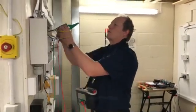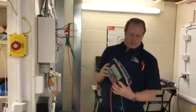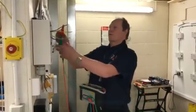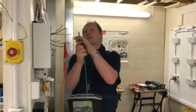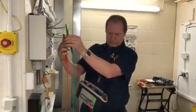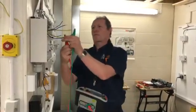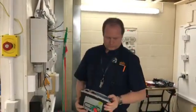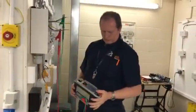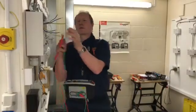For step one, we're going to go end to end. Put your crocodile clips on your line conductor, just squeeze them tight, and we're going to get a reading. In this case we've got 0.02 to 0.03. Then we're going to do the neutral conductor — 0.04 — just double-checking on our line as well, because we've nulled the leads again. 0.07 on that one, and then we're going to do the CPC.